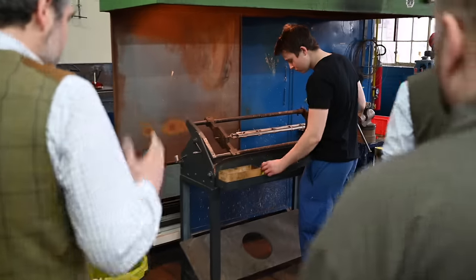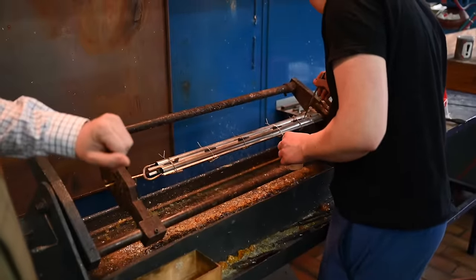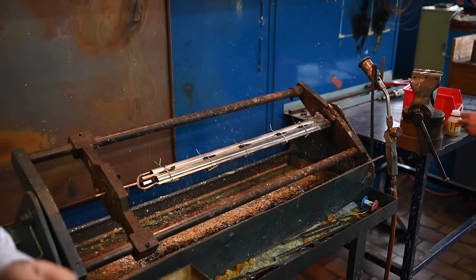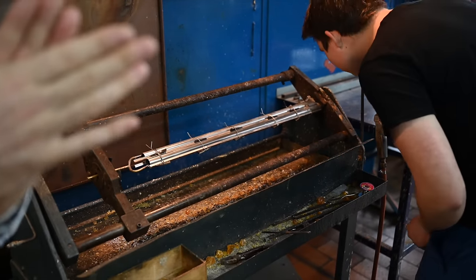So, as we explained earlier, the tubes are welded with silver. Now he puts all the side ribs and the top rib, which were adjusted with the black lamping before, just to make sure they fit the tubes perfectly. Why we do that is not because we want to waste time or to sound more clever than others, but because the tin has a maximum capillarity between two parts. If the fitting is not perfect, you will have micro bubbles in the welding, and that will make marks, or the ribs will pop out.